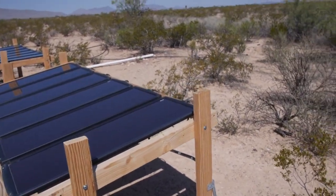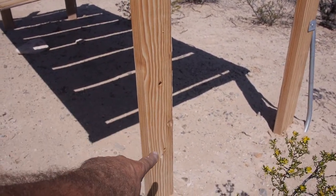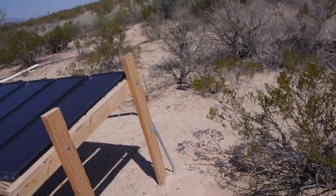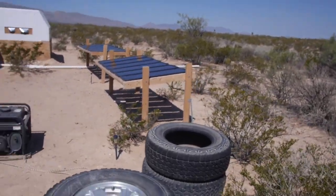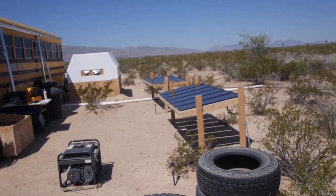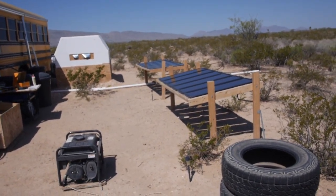I've got a series of holes. It's on the top hole there — there's a hole right here, and way down there is the last hole. So this will be September and March, and this will be December. Where the panels are now, at 11 o'clock in the morning you can see the shade way over here. Wintertime, about one-third of the panel is shaded — not ideal, because your worst solar is in the winter and then you're also shading it. So I'll probably move them a little bit this year, either higher or move them back.